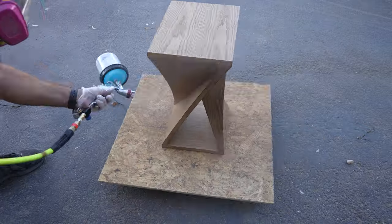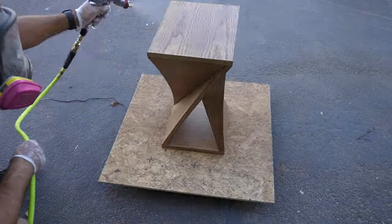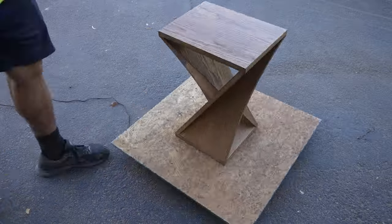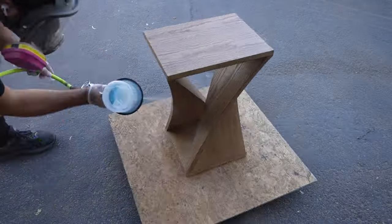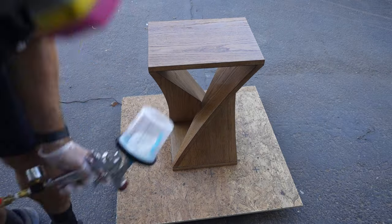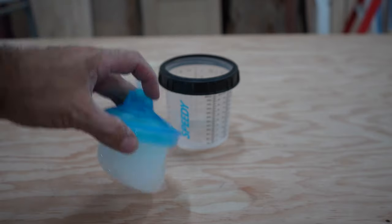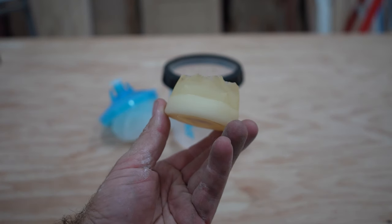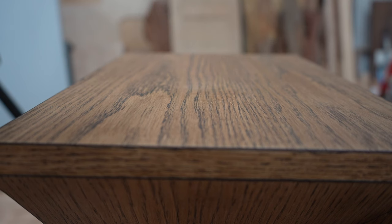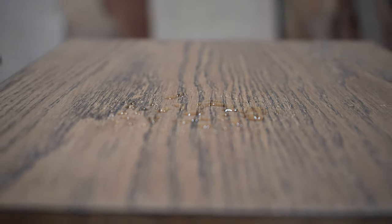It was very hot here in Arizona, so the mix was setting up very fast. Even though it looks like I'm going over a lot, there were no drips or runs. Even though this is a two-part system, I'm sure you noticed I put in three parts. The thinner isn't needed, but this product can be sprayed on a little too thick and it ends up giving the project a plastic feeling. The thinner just helps it go on thinner. I let it set up for 15 minutes and then gave it a very light sanding with 400 grit and put on a second coat. The sanding in between is absolutely necessary for proper adhesion to the previous coats. Once I'm done spraying, I take the cup off the gun and throw the disposable cup away. This is what the finish looks like if you leave it in the cup — it shrinks considerably. This was 15 minutes after the second coat. Not only did it harden, but the water already beads up on top of it. Super fast, awesome product — and no, they're not sponsoring me. Just a product that I really like.